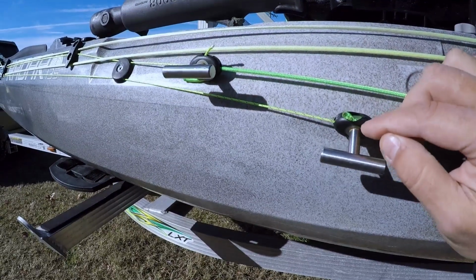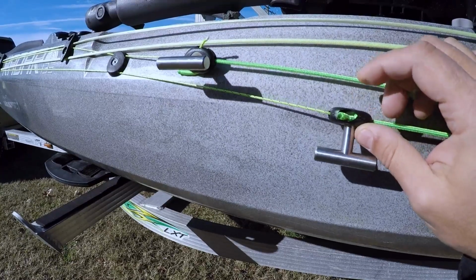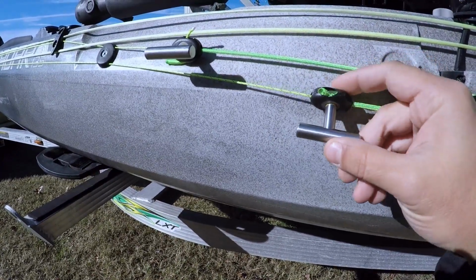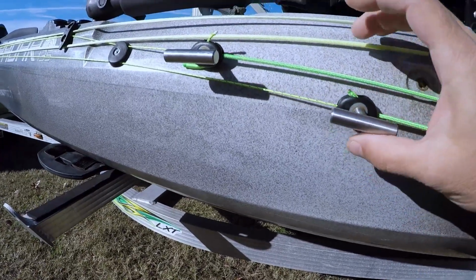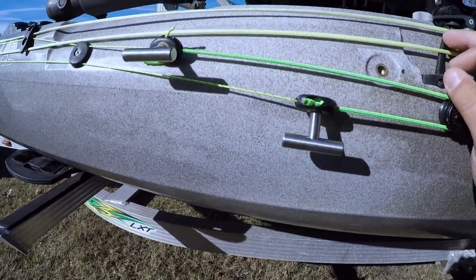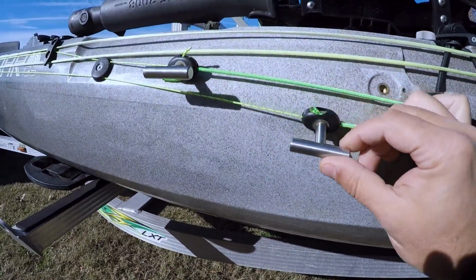They have a little metal spike on the back side, so when you drill these holes out of these pieces here, you got to make sure that it's just barely enough for the screw to go through, because you want it to be a tight fit. You don't want to have any kind of play whatsoever with this. So what I did is I drilled a hole directly through the center, same size as the screw, then put the screw through, made it line up with the handle, drove the handle down, screwed the screw until the handle hit and bottomed out, and then the little metal spike that's on the handle itself drives in. I made sure it was pretty much in line with the direction that the cord's going to be pulled, because I don't want these two interfering with each other as I'm pulling them back and forth. Because if I turn them the other way, they'd interfere and hit my knuckles and all kinds of stuff. So make sure the orientation is right before that spike drives into that plastic. I think the spike's about maybe 1/16 of an inch long, but it keeps it from spinning. So it worked out pretty good.